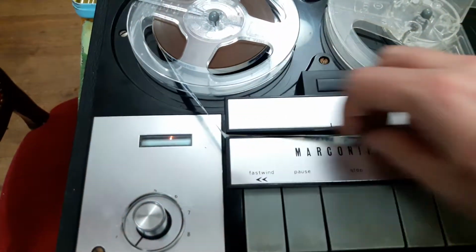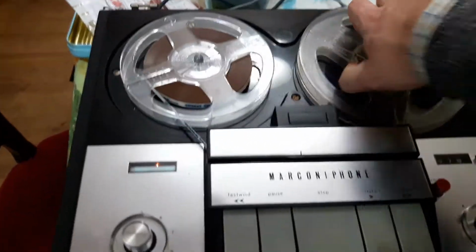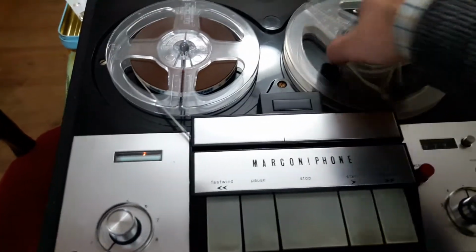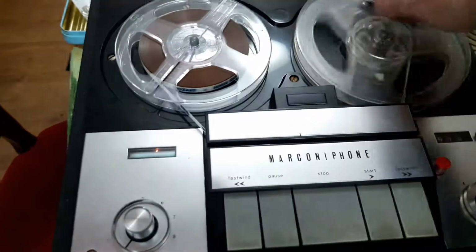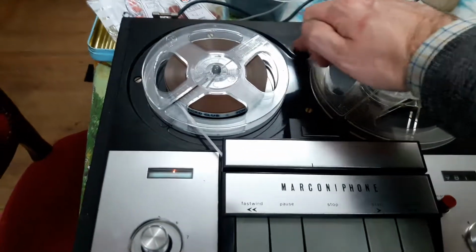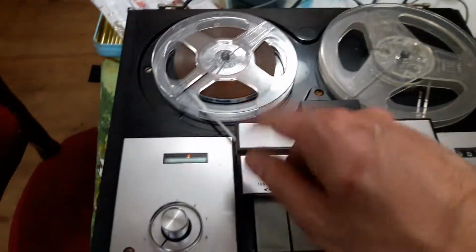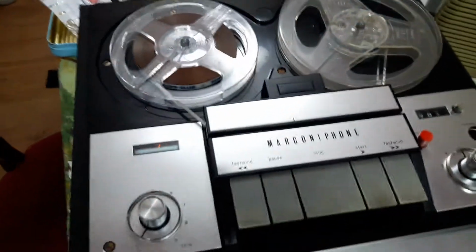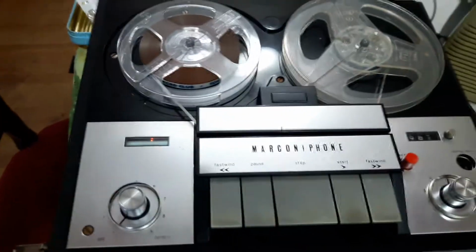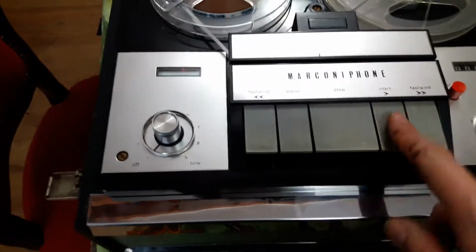This was probably one of the better, or one of the best budget brand tape recorders from this period. This particular deck, I like this deck so much because it just doesn't have many problems with it. You know, the drive belts and the rubber never goes hard or anything. So the 2-speed machine has a pre and de-emphasis control on the switch, which is nice. I think on the other one you've got an electromagnet, a solenoid to stop the tape going when you have foil on the leaders on the more upmarket model. But the basic deck is just sort of ultra reliable, really.